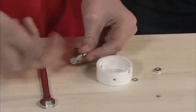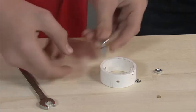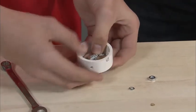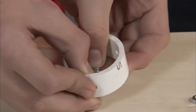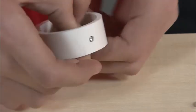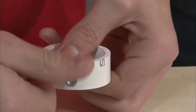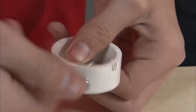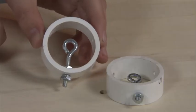We're ready to assemble the cable adjusters. First put an 8-32 nut on the 8-32 by 1 and 5/8 inch eye bolt. Then insert the eye bolt through any of the three holes in the inside of the cable adjuster and push it through. Put a number 8 lock washer on the eye bolt along with an 8-32 nut, but don't completely tighten the assembly. You'll make some adjustments to this in step 11. Now repeat these steps for the second cable adjuster assembly.